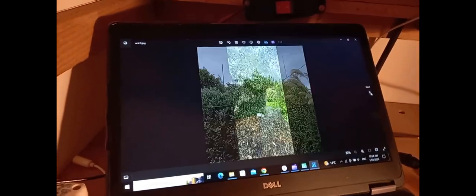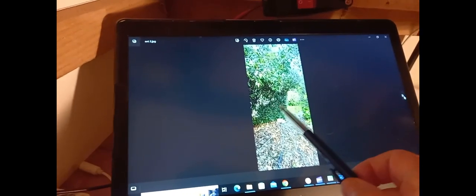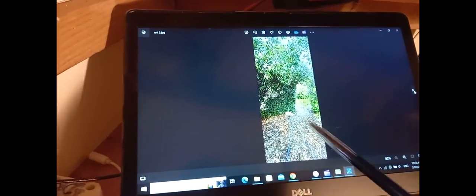This is actually the reflector — it's not a brilliant picture, but this is the reflector here, which is literally just stuck in a tree. It's not connected to the driven element, which is further to the right. It's just got some radials coming along the ground. What I've done with the radials, because it's a very small space, is I haven't put quarter wave radials down — I've actually cut them in half. So instead of being five-meter long radials, they're actually only 2.5 meters, scattered half a dozen around the base of the reflector and the base of the driven element.